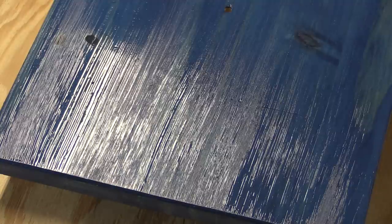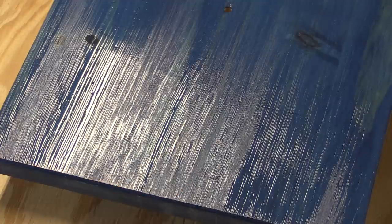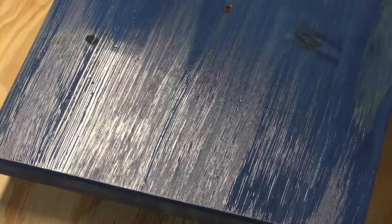We fill them up, build it up, sand it down to smooth it, then continue to build it up and sand it down again. So this isn't a problem at all. In fact, because of the sanding, since we're not going for a mirror finish, you probably have the most latitude to screw up now — if you wanted, you could apply 20 coats of this stuff to get the finish you desire.